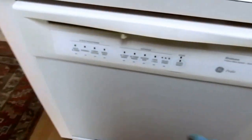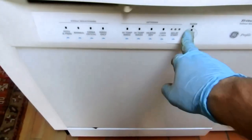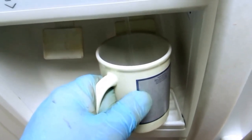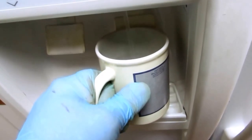Dishwasher — I'll run it on a cycle and it'll blow the hot out. Then I'll winterize it. Refrigerator ice maker here — I'm going to plug this thing in and get the water out of that too. The air is going to push all that water out. When it comes out all air, we're good. That's another thing you're going to do — dump the refrigerator, take all the stuff out.